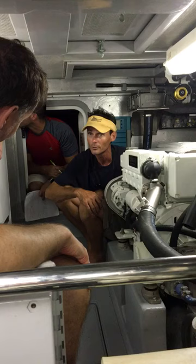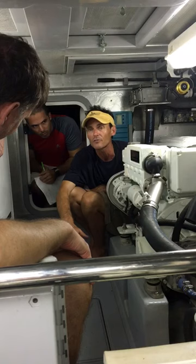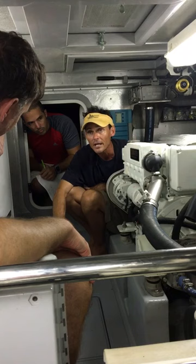With the bilge pump on, there's a float switch down there, and every time the float comes up and turns the bilge pump on, it'll draw that water out. If there's any debris in the bilge, it'll get caught in this strainer.